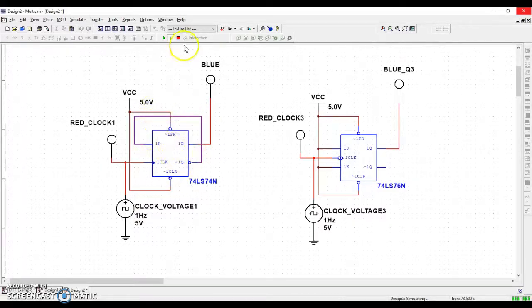The cycle is just going to repeat. It's always going to toggle. So in other words, Q not wrapping around to D is a way of taking this flip-flop and forcing it to toggle at all times. Always do the opposite of what it was doing before.